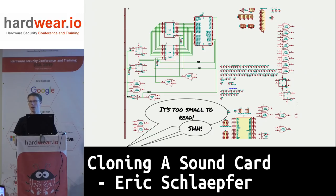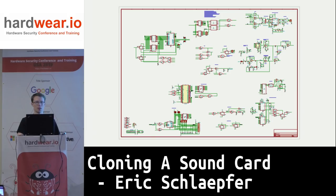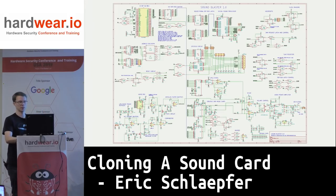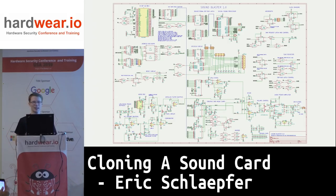Next step is to start wiring them up. Following the images I captured in GIMP, I put in one wire at a time, marking it off as I complete it. Here's some more progress — I start moving functional blocks around, and this is very close to the final schematic. I like to organize things by functional blocks: inputs on the left, outputs on the right. The line down the middle is the main data bus, which comes off the ISA card, goes through bus buffers into the synthesizer chips and also the 8051 microcontroller.